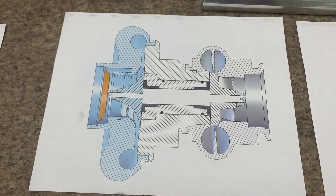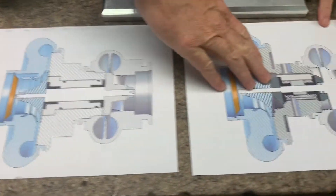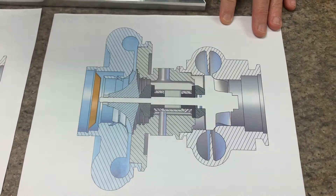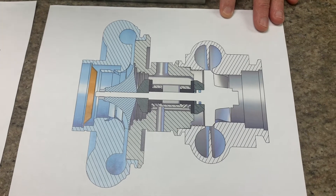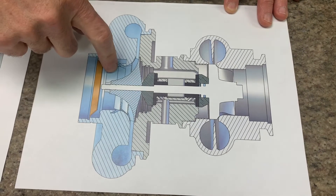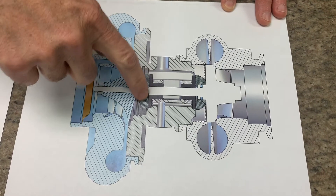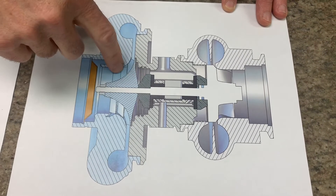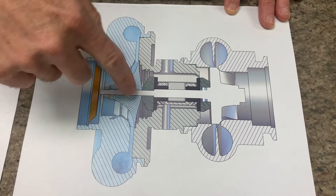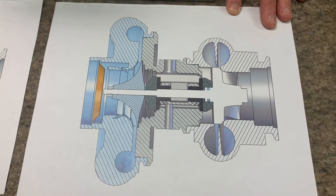This is what we think is the optimum design, though we weren't actually able to do that in this demo. What we did here was make some adaptive hardware, because these impellers are not really designed at this point to have air bearing functionality on their backs. You can see the sealing they try to affect back here, but you wouldn't have to have any of this sealing because the thrust bearing would act as the seal. That's one of our patents — the thrust bearing as a seal — which would keep pressures from the exhaust and the intake from migrating one way or the other.